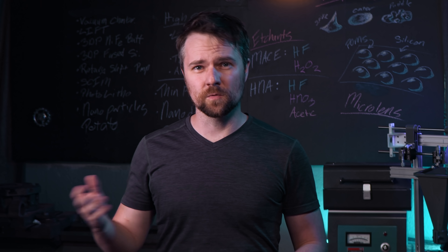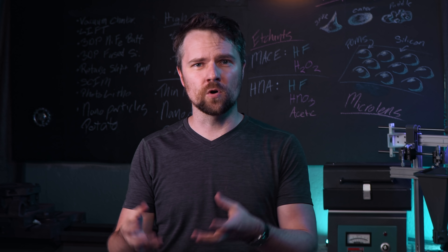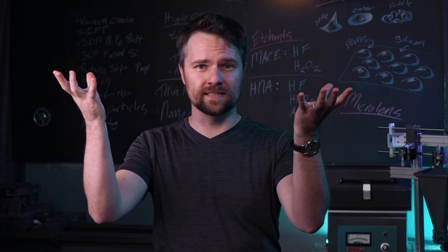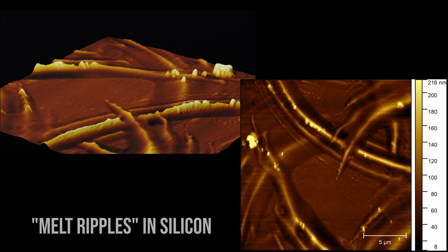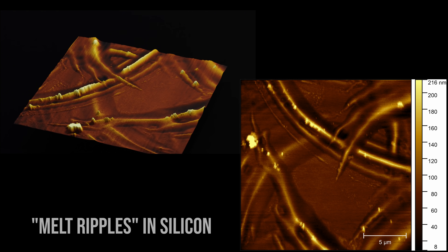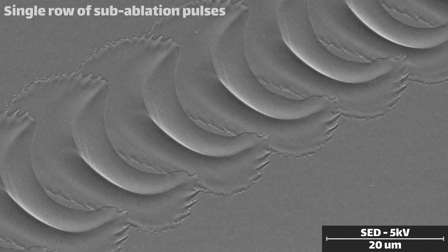From my own experiments as well as the literature, these laser pulses do a certain amount of melting in the region. Essentially the pulse comes in, it's absorbed by the bulk silicon material, melts violently, and if there's enough energy it ablates outward. But if there's not enough energy, it kind of just mixes into a little puddle and you might get some rippling on the surface. My theory was that maybe the silver layer is being incorporated into the molten silicon in that 100 nanosecond time period.